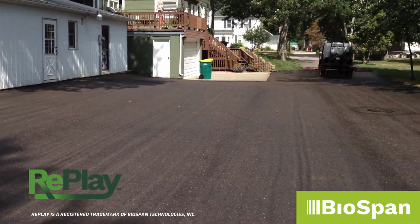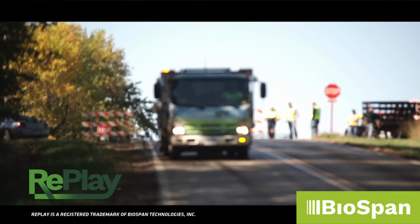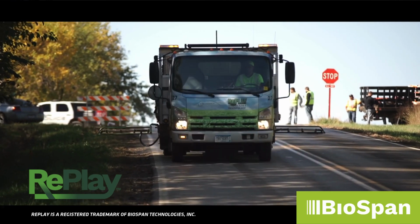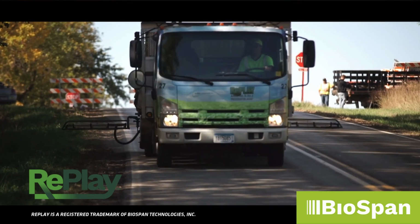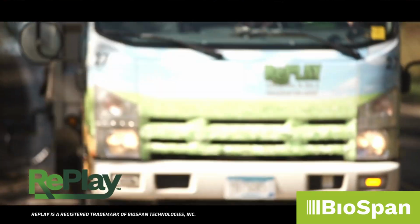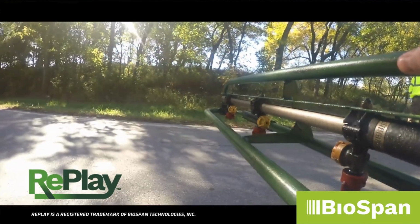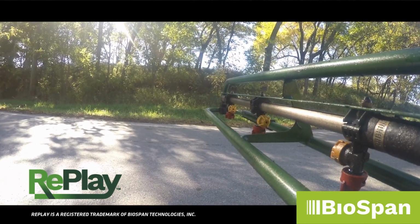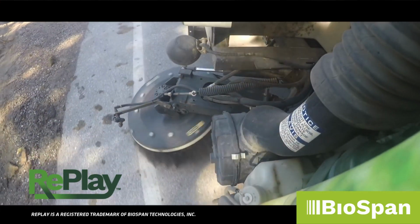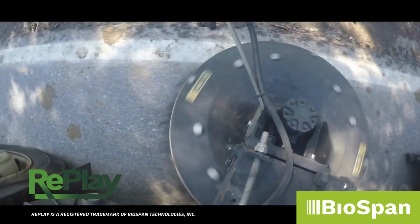But what about cold weather? Don't roads tend to crack more easily in freezing temperatures? You're right. Low-temperature cracking is a major concern. That's why they did a specific study in Clear Lake Riviera, California, to see how RePlay-treated asphalt performed in colder conditions. Okay. They used a bending beam rheometer, which basically measures how brittle the asphalt is at low temperatures. So they're trying to simulate those frigid winter conditions and see how the asphalt holds up. Exactly. Got it. And the findings were encouraging. RePlay-treated binders were less brittle and better able to handle stress at low temperatures compared to the untreated ones.